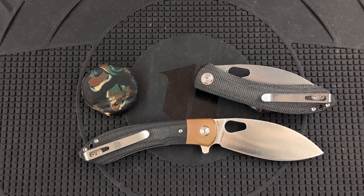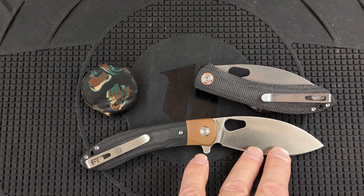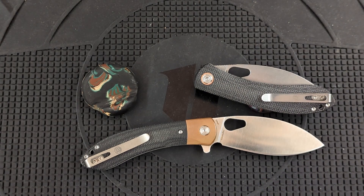I don't like a smooth, polished edge. A smooth, polished edge likes to slide off material instead of grabbing it and slicing right through. So even after this knife lost its fine edge, its working edge still went on strong for a long time. And in use, maybe it didn't cut paper quite as good, but in daily use you didn't notice a loss of sharpness. And that's what you get from that coarseness and from that very aggressive toothiness that the blade has.